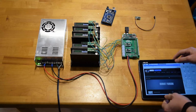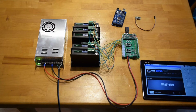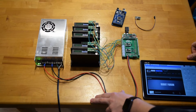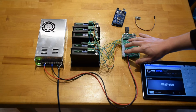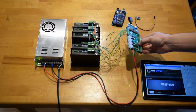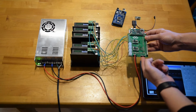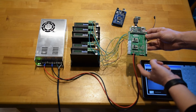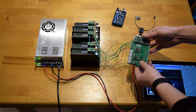So that's what I've got today. Next steps are going to be hooking up the Arduino finally, and the rest of the motor control. I've got those taken out because I've got them wired up to the robot for now. I've got a couple of I/O, I might have mentioned in a previous post, for separate tasks. I took those out on the files that I uploaded, but basically calibration comes in here, the calibration wires, and I've got some really small surface mount resistors in there, so that I only need to run 2 wires out to each calibration, and then these are all the rest of the input output.